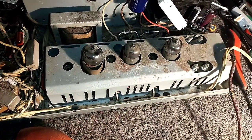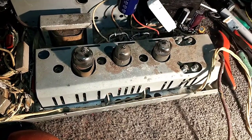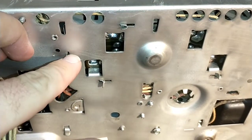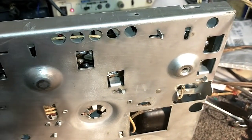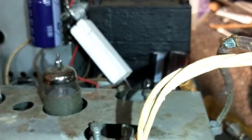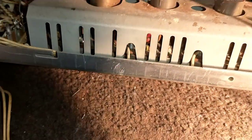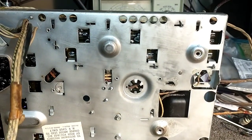So now what we need to do is get the shield off and take a look at the board and get the board up. To accomplish that we need to bend all these little tabs so that the shield will pass through the holes and we can lift it out. Also make sure to undo the little cable clamp for your coaxial there.